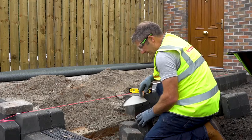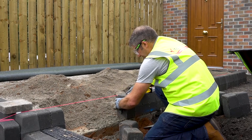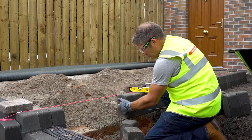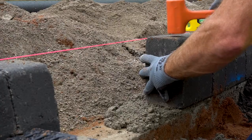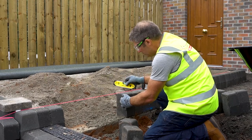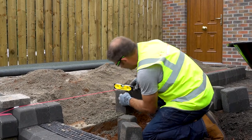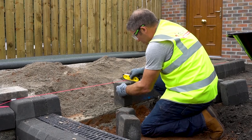We've got our mortar on our kerb base now, and we've got to make sure that when we're tapping down, we're tapping down sufficiently enough to ensure there's a good bed underneath. Try and hold your kerb in position like so, tapping it down with your mallet, but always make sure you use a spirit level, because your spirit level is going to make sure that the top of your kerb is touching your line. You need to get down and have a look at what you're doing.